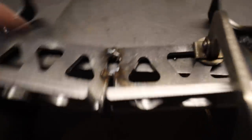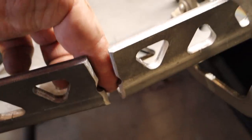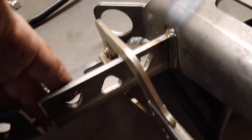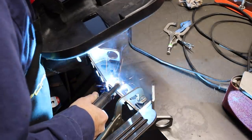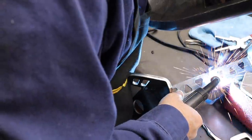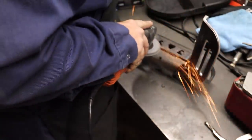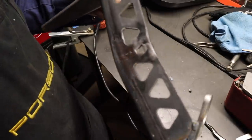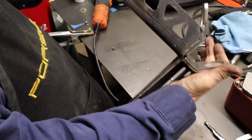I've welded the front side of this thing and I'm going to try to fill in this area with weld. I think I'll find a little piece of scrap metal and weld it in between, or make a plate that crosses over on each side. Ideally I can make a wedge that fits in between and weld the entire thing up. After a grind it looks really nice and clean. I didn't do too much on the inside because I want the structural integrity, but I'm pretty pleased — it looks pretty factory. I'm going to give it a quick coat of spray and move on.